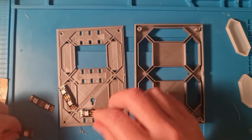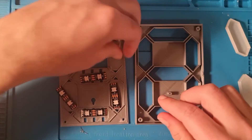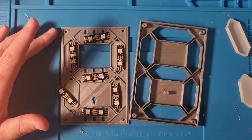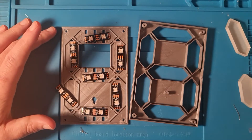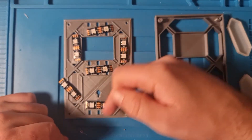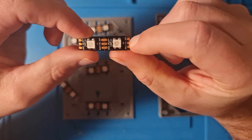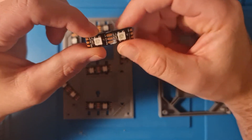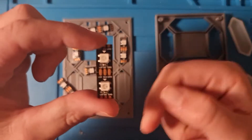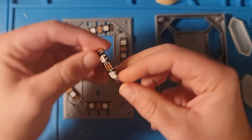Now we have seven strips and they will go into their pockets like this. The direction of the LEDs is very important. These segments are going to be connected alongside each other because we're going to have four or five of them — we're still playing with ideas. That means I'm going to need wires from the outside wall back into this. I'm going to make sure my input is on this side — going down, up, and then out. These LEDs have marks which are arrows, so you have to connect them in one direction. These LEDs have a sticky tape at the back, so you can just take that off, make sure it points down, and paste it in.